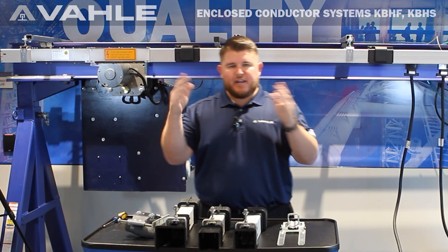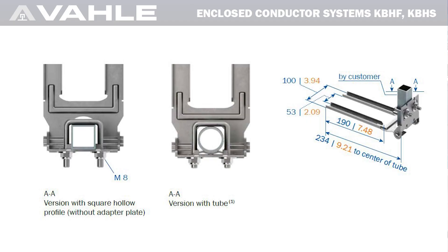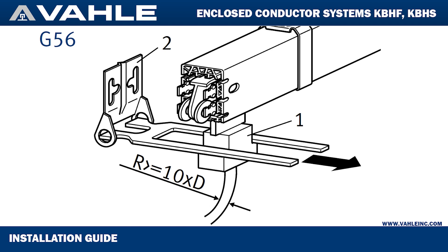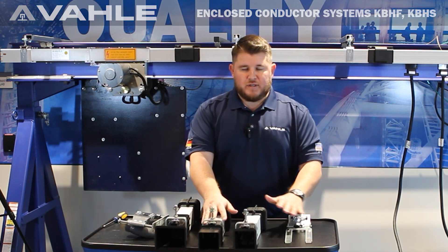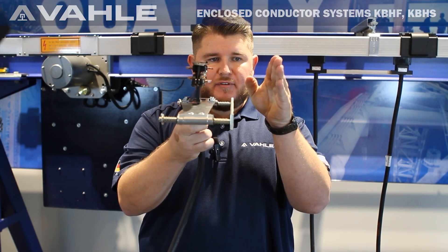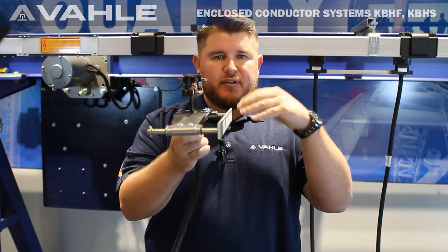This will keep the collector up in the air so it doesn't drop. But if you were to get a funnel and use this regular tow arm, as it's going through the system it's tracking straight, and as soon as it gets out of the system it'll just fall down — that would allow your collector to fall down. When you go back to get it back in the system, it wouldn't be there anymore. So only use the regular tow arm for guides or a regular runway, and then the flexible tow arm for funnels. This has some flexibility side to side to account for if your machine is not perfectly aligned, your hoist is swaying, or your forklift isn't right on the track it needs to be. This allows it to go back and forth in order to counteract that off alignment.